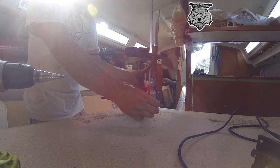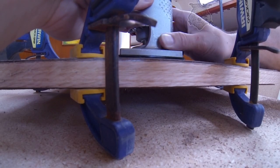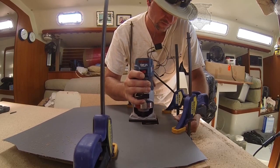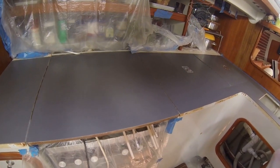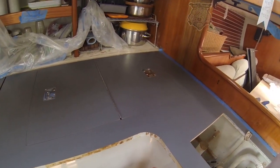Now I'm going to make the laminate for the cooler — these go on the top of the cooler. So what I've done is I've made a jig. You can see how I use the old top as what I'm going to use to route the new one with, especially for where the handles go. I just lined up my bearing bit with the bottom one and cut it out. Here's the finished product of cutting out the holes, and then once I put it on the tops, I just routed the edges normally and you get a perfect top for the coolers.